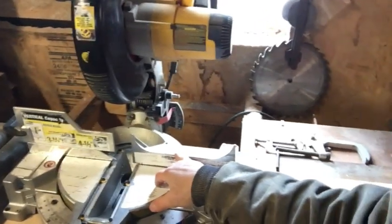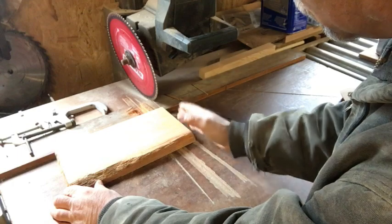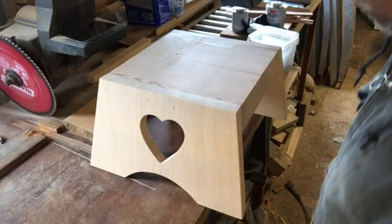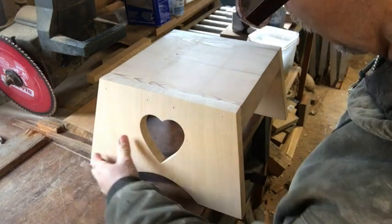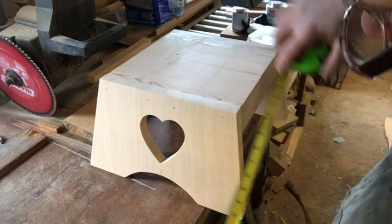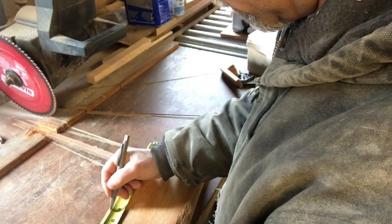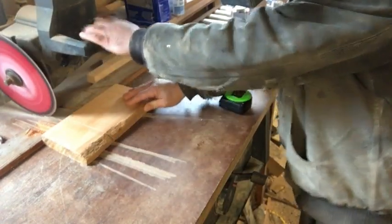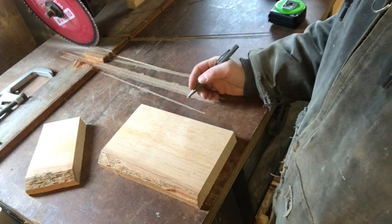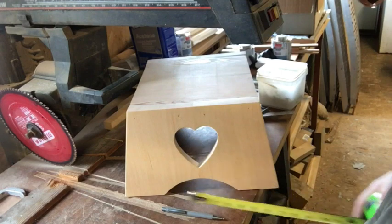You can also do the angled cuts with a miter saw with an articulating head, but this will only cut so deep. I set this up and set the radial arm saw for a 10-degree cut. I want to continue that same slope on the top side, so I measured out how far I wanted to come with a tape measure. Keep in mind we're making half of this whole leg right now. We've got one side cut, now we want to cut the bottom side. I got this at eight and three-sixteenths, so I measured over eight and three-sixteenths and then cut all of these cuts at once to streamline time.